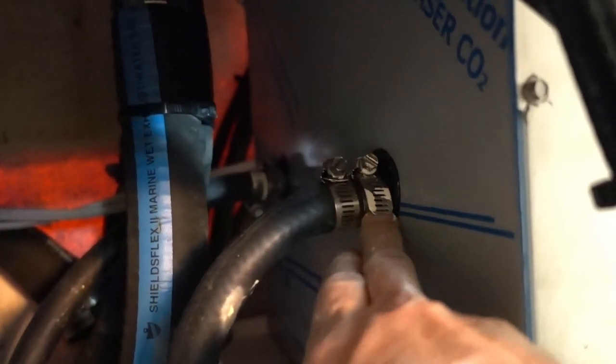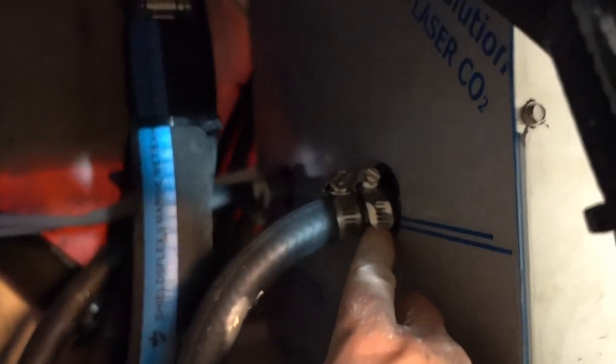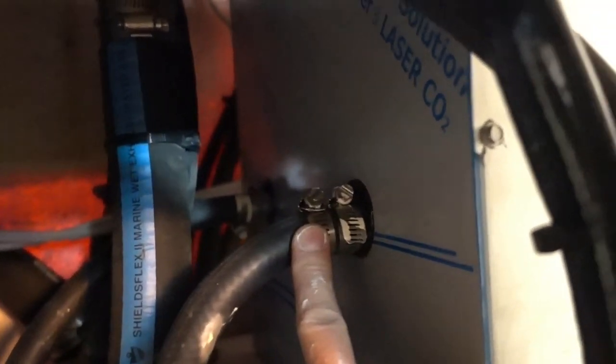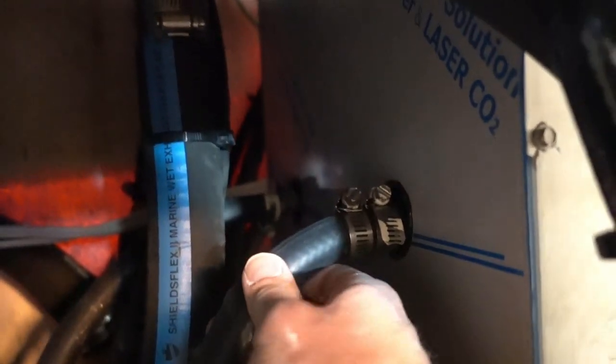All right, so I pushed the hose in another 1/8 to 1/4 inch, really crammed it in there, and then backed it up with two hose clamps. Neither of these were even being used, or they were loose on both of them. So I'm wondering if they ever tightened them down. Now you can no longer turn it by hand. They're on there. I didn't visually see any leaks coming out of there other than maybe a wet fingertip right here. So I think maybe it happens under pressure.